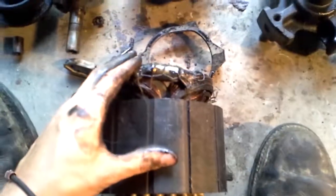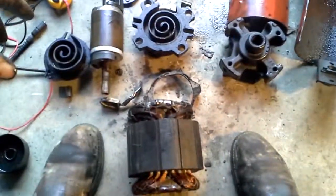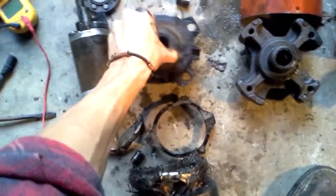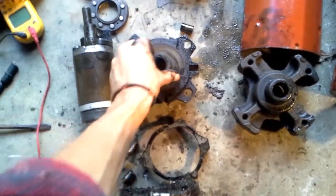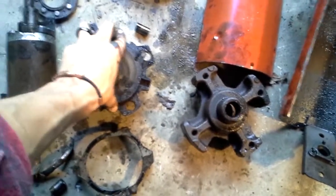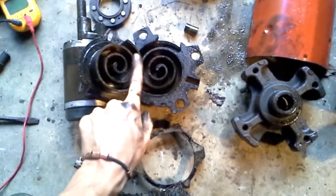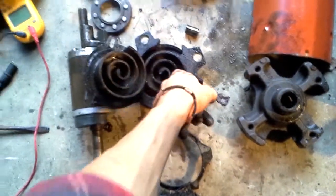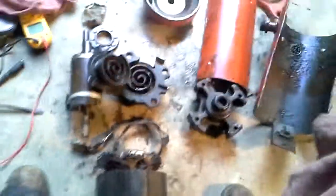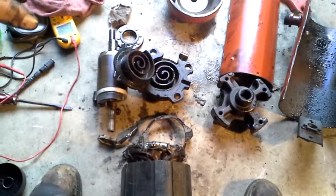That's it — that's the guts of a Trane scroll compressor and how they work. The scroll oscillates; you'll also hear these making contact because there's nothing in it when you're pumping the system down if pressure gets too low. The seal gets tighter and makes the compression space between the face of the oscillating scroll and the stationary face tighter and tighter as pressure builds. It's actually a pretty cool design.